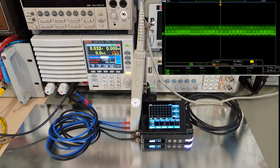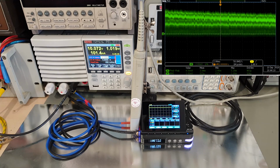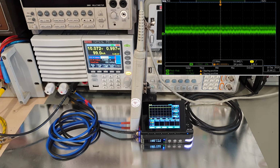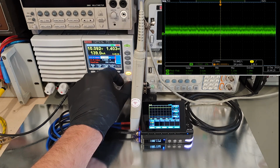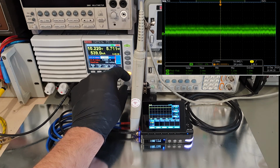I'm positively surprised here, but I have to say it. The output doesn't even have to be enabled for the MDP under test to exceed its 250 microvolt ultra-low ripple spec. Be it RMS or peak-to-peak, this is still a spectacular result for such a compact boost converter.